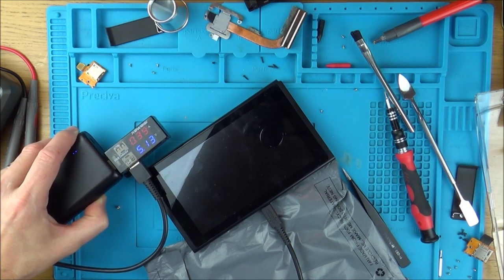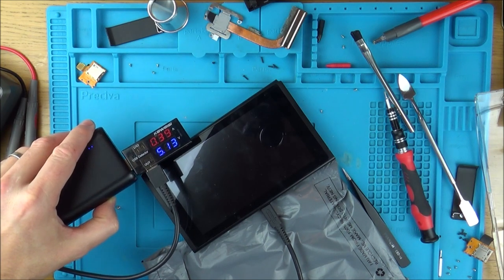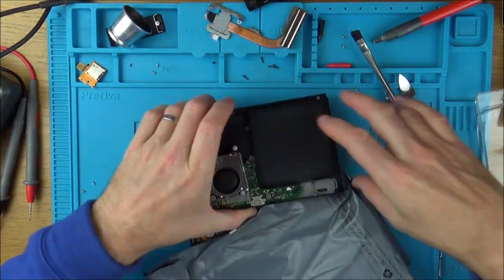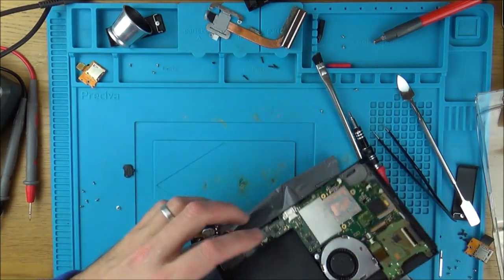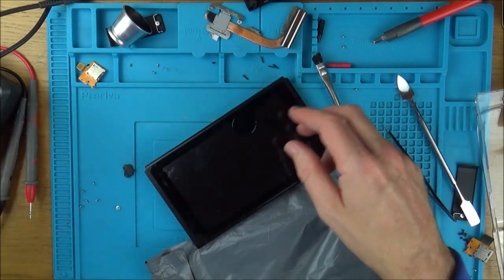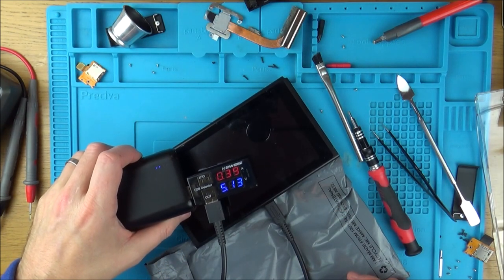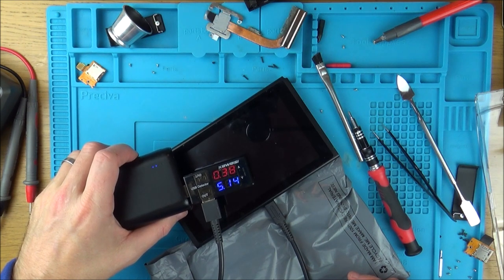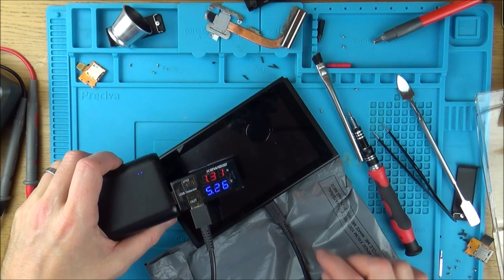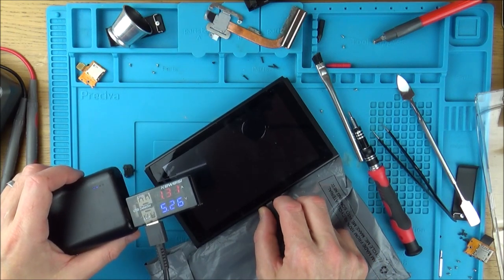I've got it back together with the different screen — only the basic parts are in; the on/off switches aren't on this one. Let me plug it in to see what happens. No — it's not turning on again. So it must be that when I plug in the ribbon cable for the screen, it's stopping the switch from turning on. Those pins must be shorting together inside somehow. Let me unplug that again. Now with the ribbon cable disconnected from the screen — let's see if it will turn on. There it is — 0 and 1.30. So when we plug the screen in, it's stopping it from turning on.